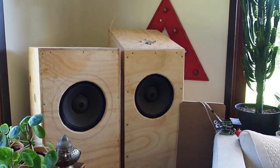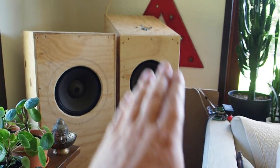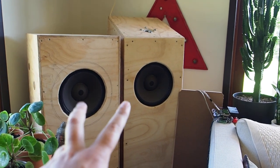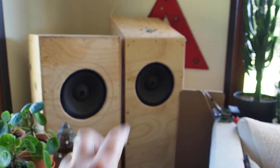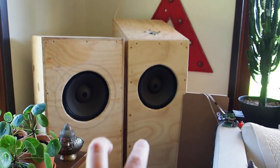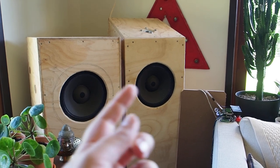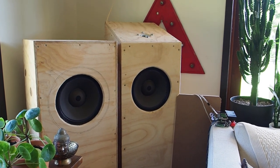Another sound quality breakthrough came when I doubled up the woofer and made this into a single larger speaker. I doubled the surface by adding a second cabinet — this one doesn't have a compression driver. So it became 8 ohms: two 16-ohm drivers in parallel giving 8 ohms. I tried them in series but it wasn't a good idea. Parallel sounds much better. I was concerned about interference — cancellation patterns — from crossing two drivers quite high, but it was extremely mild.